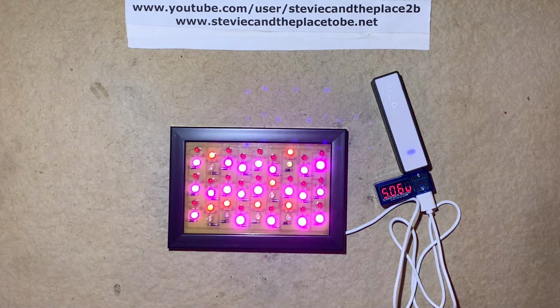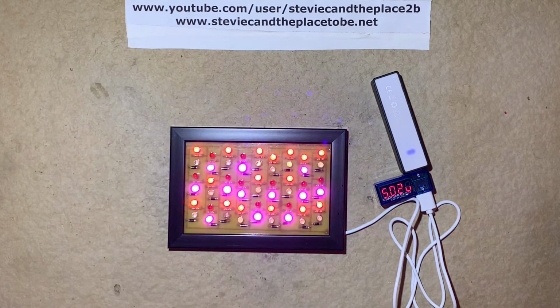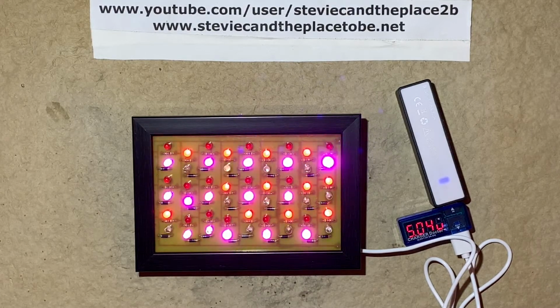So there you have it. My gallium knockoff with flashing pink LEDs. Was originally going to be called Semi, but I think, rather appropriately, it will be called Arse, because I've made an arse of producing the board. As you saw, I had to tin the tracks to provide continuity, as the tracks had been broken possibly due to overexposure again, or overdevelopment, or both. But better luck next time.